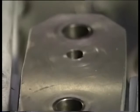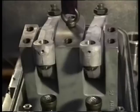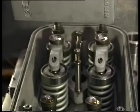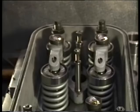Remove the bolts and place an M16 bolt or a hoisting plate in the provided threaded hole on top of the rocker arm support. Subsequently, lift the rocker arm support from the cylinder head. Then remove the push rods one by one.